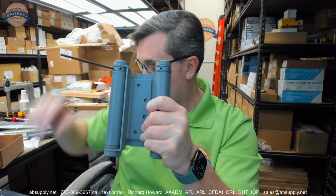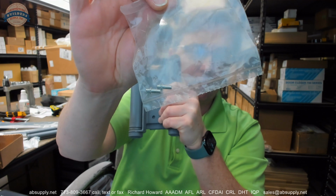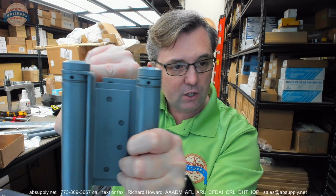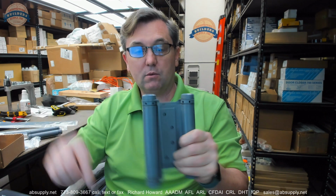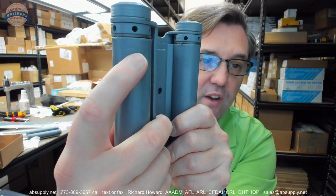Okay. For every hinge that you order, you'll get 2 tension pins. That long end is what you're going to put down into one of the new holes that you reveal. And then you'll make adjustments. That's simple. That's all you do. If it's on the bottom, you're going to rotate it counterclockwise, is the bottom line. Okay? So clockwise, when it's at the top, there is an arrow on the barrel of the hinge right at the tip of my finger.